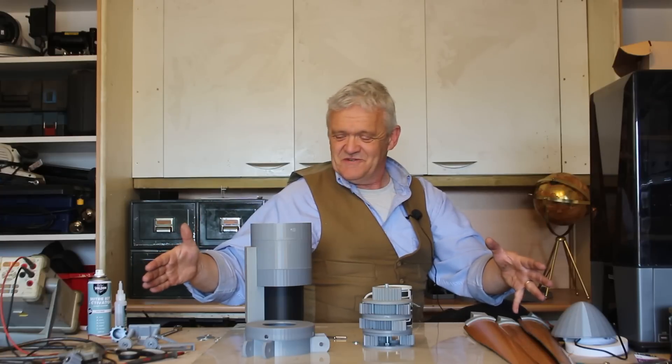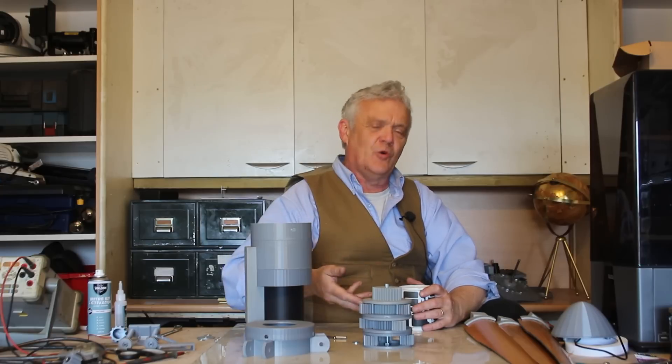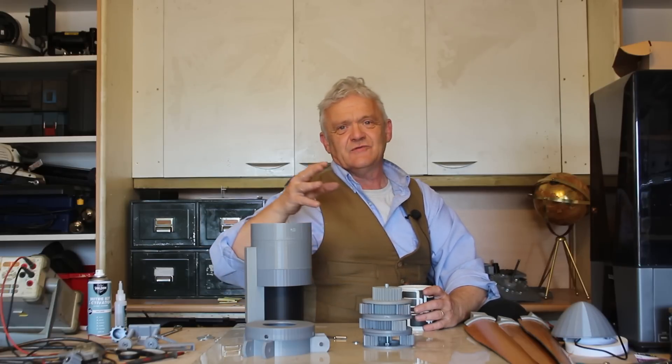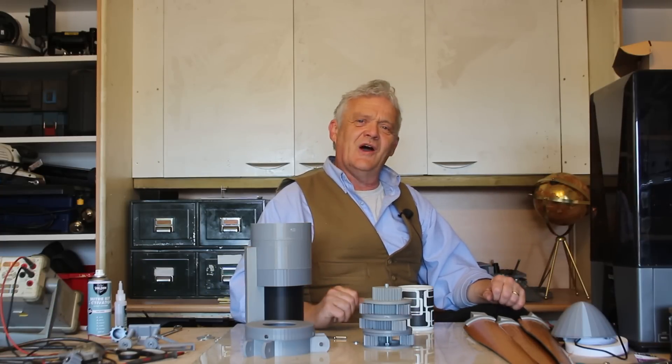Notice the collection of parts? That's because we've got a good news, bad news situation. Good news first: it worked! Contrary to some people's belief, it turned in the wind. The wind speed was 4.5 meters per second — it actually began turning at about 4 meters per second. It got up to 4.55 meters per second and was turning beautifully. So it does have quite a high torque for initial start, but once it gets going, it gets going — which is really cool.